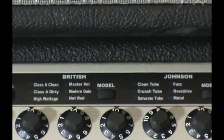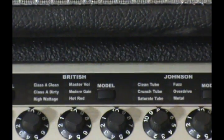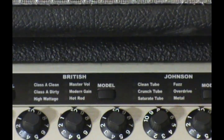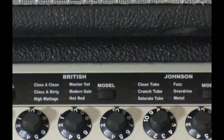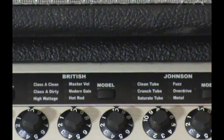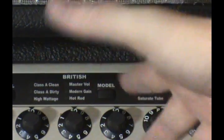But with the Millenniums down there, they will tell you the Marshall, the model number, everything, the frequencies of the highs, the lows, and mids. They actually match the exact frequency from that amplifier down to every detail. When you get into different amplifiers that don't even have mid-range controls, of course the mid won't work, but on the Millenniums they match every single thing, and the frequencies match. So if the bass is 80 hertz, it's going to be 80 hertz on that Millennium amplifier. Up here, they don't name anything, so it's just a crapshoot, but they give you kind of an idea.